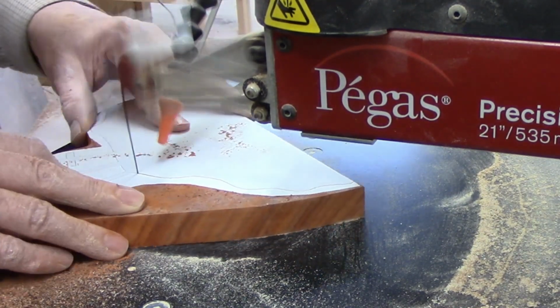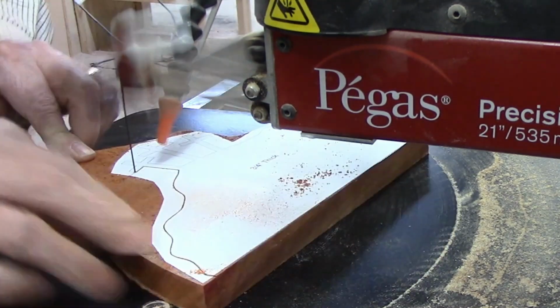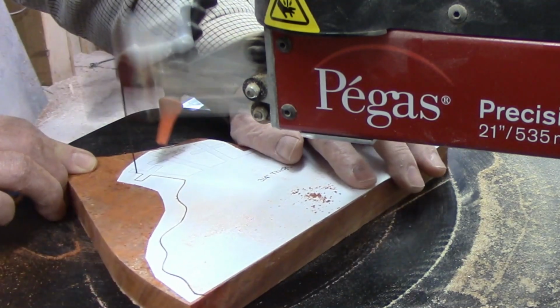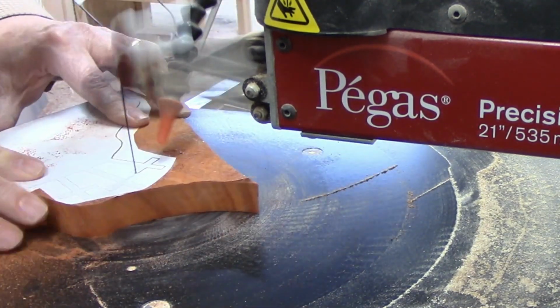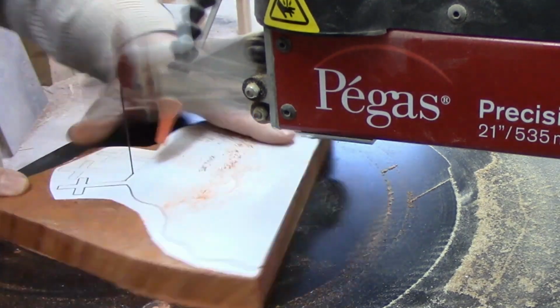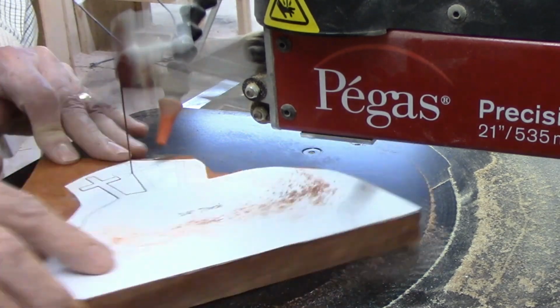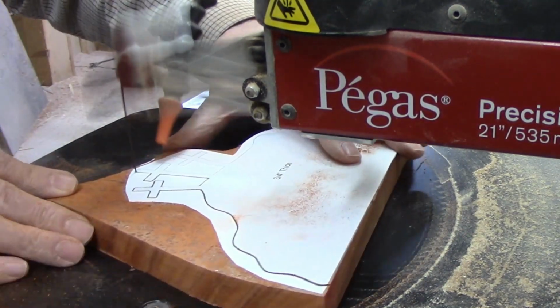As always, I recommend cutting straight up to the intersection, then backing off slightly with the blade while you pivot the workpiece. Then start cutting again in the new direction. Since the tops of the crosses are near the edge of the board, when you get to them, you can keep cutting until you reach the edge. That will create a small waste piece, which you can easily remove. Then you can start cutting straight into the next section.